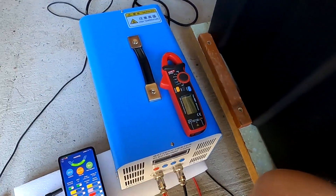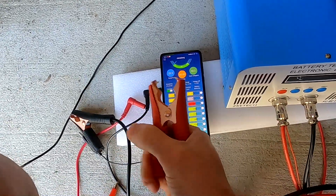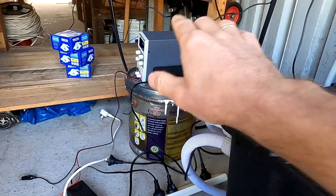I got the Chinese charger out again and started connecting the big clamps to single cells, recharging them to 3.6 volts and letting them absorb. Some reached 3.6 volts very quickly while others took 20 to 30 minutes. Then I used the power supply — it was already dark — connected to the Blue Eddie, and charged the battery higher and higher very slowly, increasing the voltage and charging and discharging single cells to balance them.